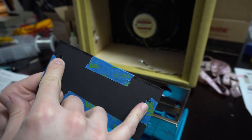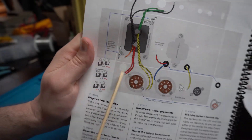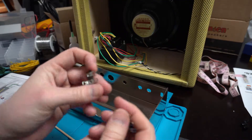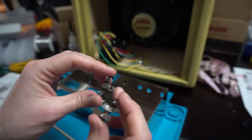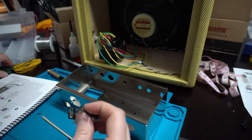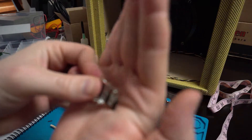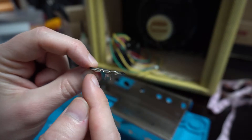The instructions are telling me to set this aside and we'll start prepping and mounting some of the other components onto the chassis. Next step, we're going to start mounting the power transformer inside. In addition, there are two terminal strips that go on the corners that serve as grounding points. To prepare the terminal strips, the instructions want me to go ahead and cut these down in half because the holes are a little bit small and don't fit over the power transformer. Cutting them allows them to be put up against it without having to go over the lug nut. Additionally, it wants me to use some ground wire that's going to get laced into the terminal lugs to create a ground bus and tie all three sections together.